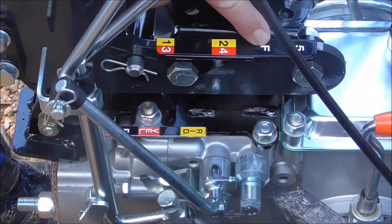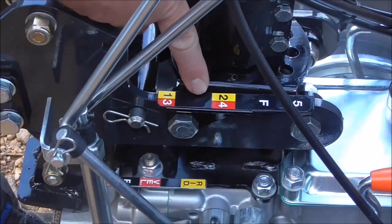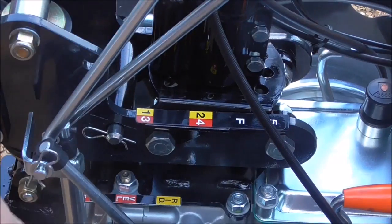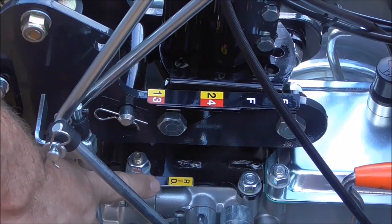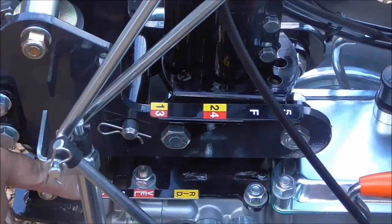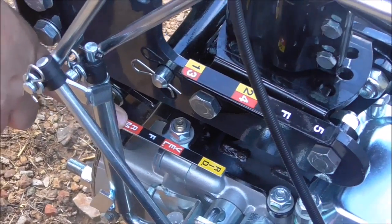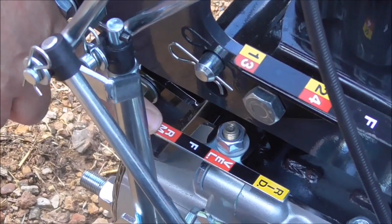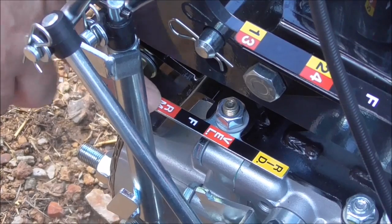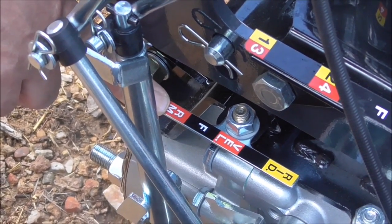The F position is neutral here and also down here. In between you can kind of find a neutral — it's not labeled, but if you have any of these shifters in that position, it's essentially neutral as well. This down here is reverse. This is RM — basically your reverse or forward depending on which way your handlebars are. Currently the machine is set up in the mowing, front mount position, in which case this is actually forward. The reverse gears from the standard position become the forward gears.